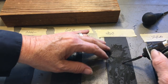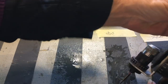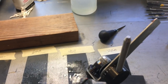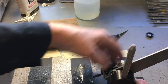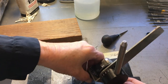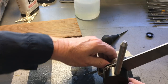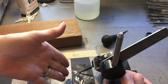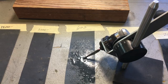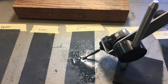Now we're going to move on to the 400-grit — same process. You could hold it from the back of the handle, but I obviously have more control holding down here. You just want to make sure you don't turn the knobs and loosen anything up. Do this until you have a uniform finish on the face — you don't want to see the prior sandpaper's marks. Then move on to your 600, your 1000, and your 1200-grit. Just a couple of swipes on each one and you should be good to go.